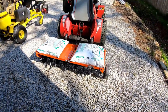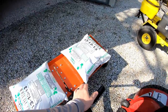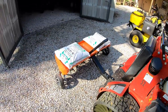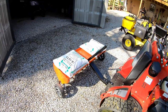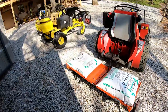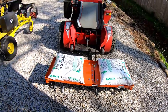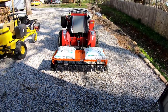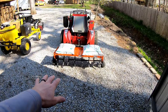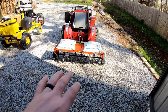The advantage of this unit is that it's much lighter overall. It has nine-and-three-quarter inch transport tires so you can drive around with it, then just shift a lever to drop it down into aeration mode — easy one-hand operation. The tray on top holds up to 175 pounds of weight to get the depth of aeration you want. Right now I've got a couple of 50-pound bags of fertilizer on the tray — 100 pounds — just to get me by. You also have 48 inches of aeration with eight sets of tines.